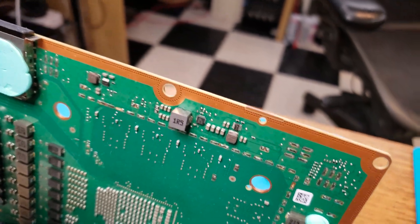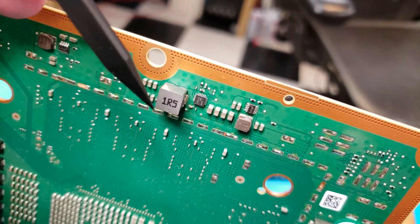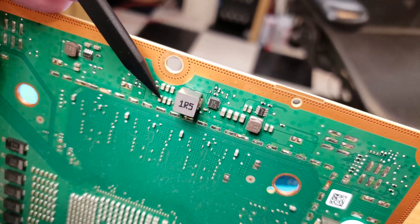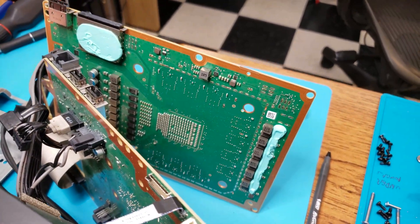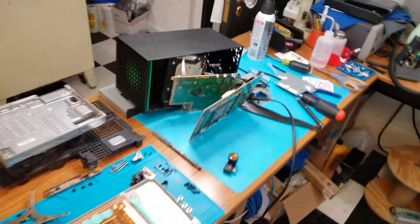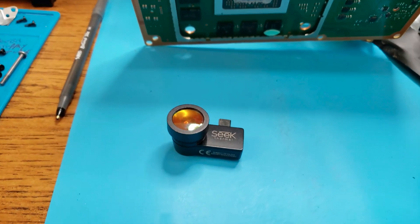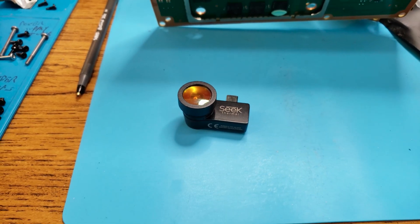Back to regular video — here's what we were looking at. You have a coil and then a bunch of capacitors, and this is the capacitor right here that was getting really hot. On this board, on this machine, I don't understand any other way I would have been able to figure out what was wrong. The thermal cam is just an invaluable tool for fixing today's devices.